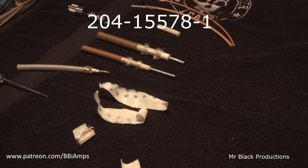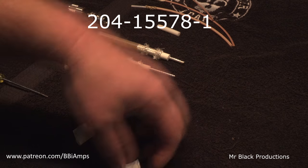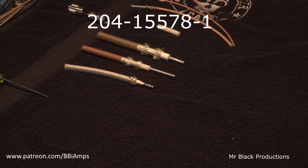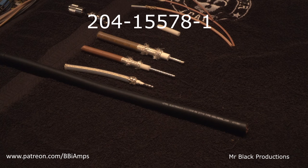It's commonly accepted among most radio operators that the 393 is kind of the top cat's meow. Then, to move forward as far as flexible coax goes — that's not a heliax — most of us will automatically jump into the RG217 universe, which is here, or start spitting off LMR numbers like LMR400 or LMR600.